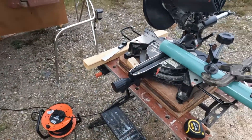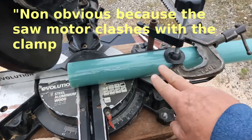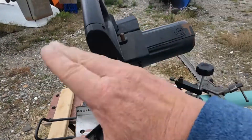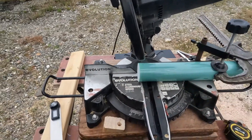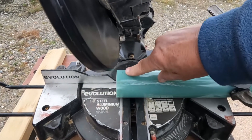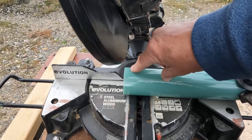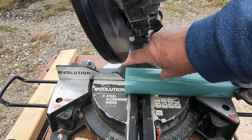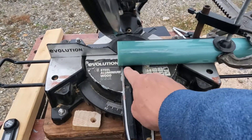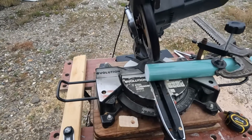Sorry about the howling wind. I'm ready to try cutting my first tang. I've put the FR4 into the saw from the non-obvious direction — normally I'd feed from the other side with the clamp there, but you can only angle the blade one way. I've angled it, cut wood, and tested the angle with my electric angle gauge. By cutting it this way I can measure the critical dimension — the top of the tang — which is set to about 14mm: that's a 9mm shroud plus the anti-chafe sleeve around it with a little wiggle room. I've angled it this way, so let's cut it now.